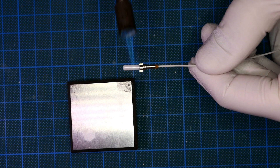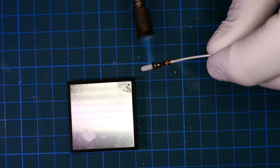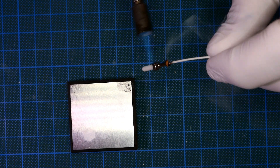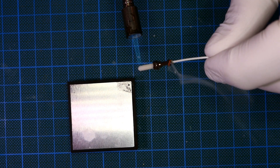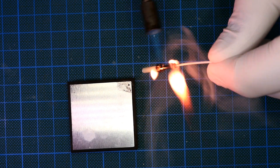This flame is used to heat the ferrule. Note that both the ferrule and the glass fiber are not affected by heat. The glue holding the fiber and the plastic coating is burned away. This may seem crude but is very effective. Obviously a well ventilated area should be used for this procedure.